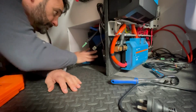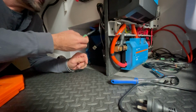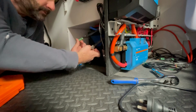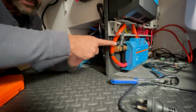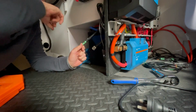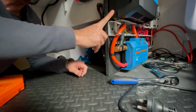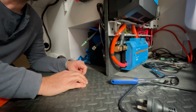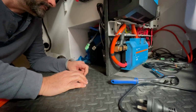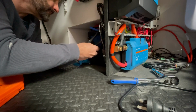Okay, here goes nothing. So the battery's mounted in under here, which you would have seen previously. There's some tie down straps. Yeah, that's the negative from the battery, and that's the negative to the panel. I've already connected the positive, which is this big chuba here, goes around and all the way to the front. Had to connect that before you slide the battery in. And yeah, I've got capacitors in these inverters, which slowly leak over time, leak out current. So I'm expecting a few sparks here because it'll make a connection and drain power, which usually means sparks, I think.